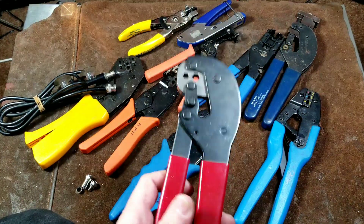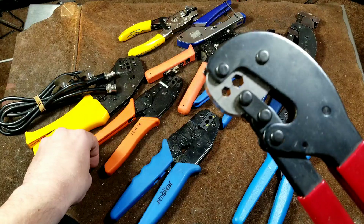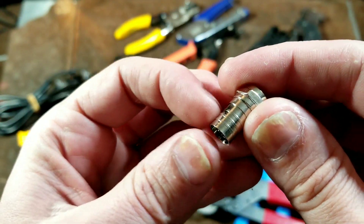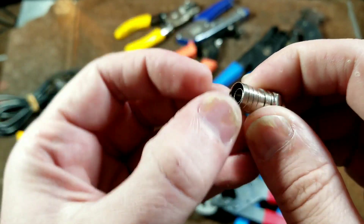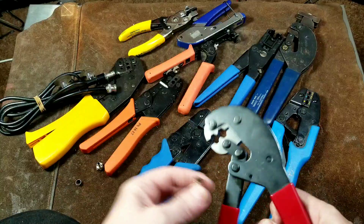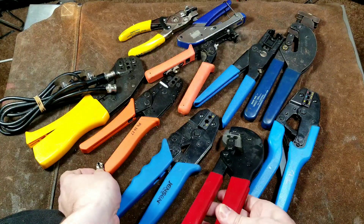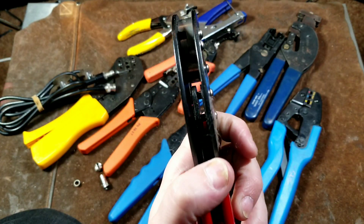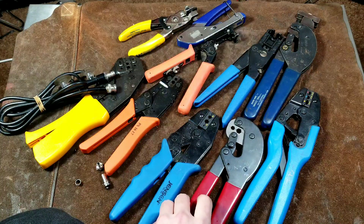Here's more of a knockoff, but this would be what CablePro had for the more standard versions where you compress the collars. How these work: you strip your cable — usually a quarter inch of exposed wire and a quarter inch of the inner exposed sheathing and insulation. You fold the little wires back, push the fitting onto the end of the cable, then come in with a pair of these crimpers and crimp them, making a little hex that holds it tight.